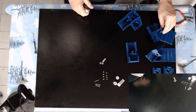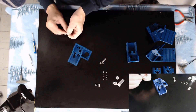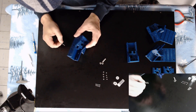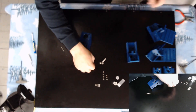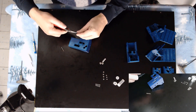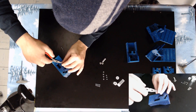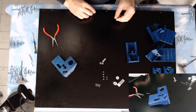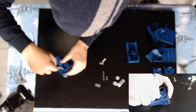That's the second stepper motor mount. Now we're going to work on our rear idler assemblies. The original design I used was a D-Bot design, and whoever did this made it to have two nuts inserted in those slots. I didn't get a chance to remake it to use heat sets - there are times I really wish I had. This is probably the hardest part of setting this up: getting the nuts to line up correctly. You want to make sure that you've got it slid in with one of the points at the top center, so you've got two flat sides going down along the wall. Depending on your printer's accuracy, you may have to file that just a little bit. Just make sure it's not too loose a fit or the nut will spin inside instead of tightening up.